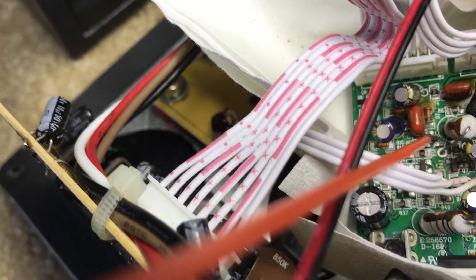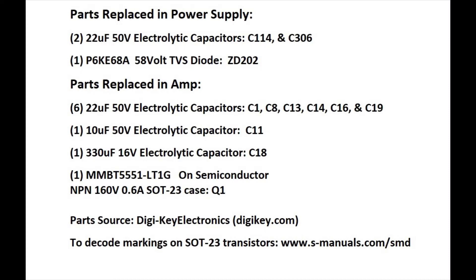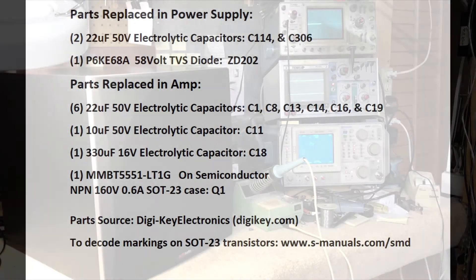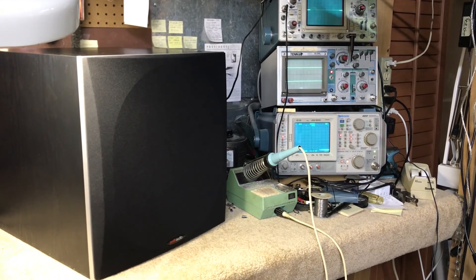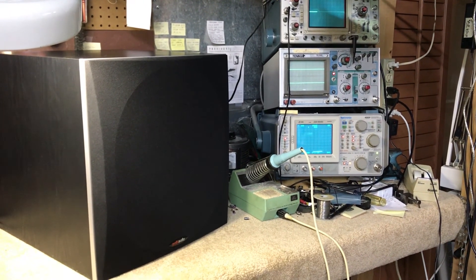After moving the wiring harness over, there's a little transistor here — Q1 — that takes just a drop of freeze spray to kick it back on. I'm going to replace Q1. It's an MMBT5551, a very small transistor marked with 'G1' on the board. I've added a link to a website where you can see how to decode the two-letter designation to the actual part number. The subwoofer is back together and has been playing for about three hours now — we'll call this one fixed. Thanks for watching.